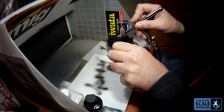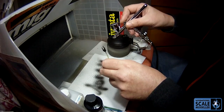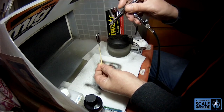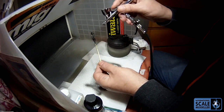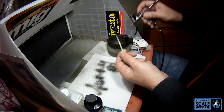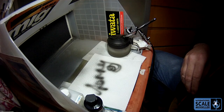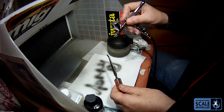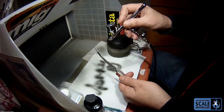Spray's quite easy. You're getting quite good coverage on it, and that's even just with a light mist coat. No issues at all spraying it. Seems to be clinging really nice, so I'll just put that part aside. Some people have problems if they don't use the right pressure for shooting it through, but as I say, 25 psi in my Iwata. No problems at all so far.